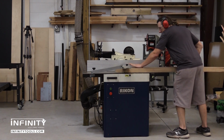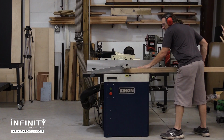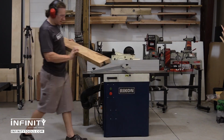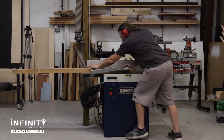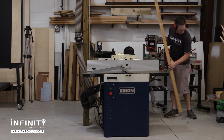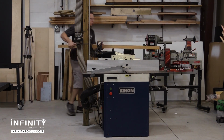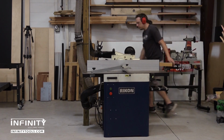thud. Next, I decided to make some edge banding for my top to dress it up and add a protective detail. I had a piece of hickory sitting in the lumber rack just waiting for a project like this. So I took it to the jointer and planer and milled it up till it was nice and smooth into a good dimension to make those edge banding strips from.